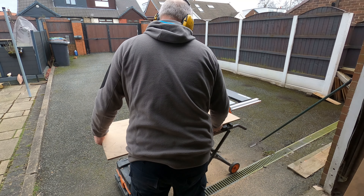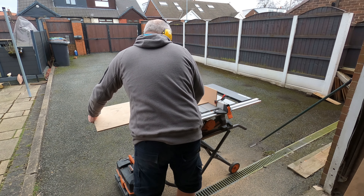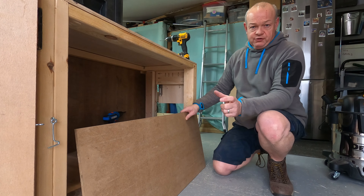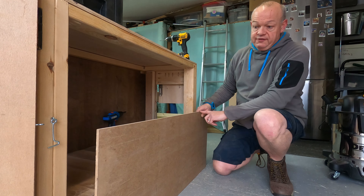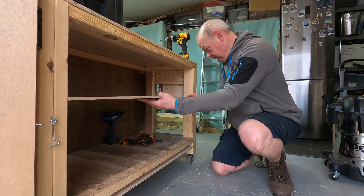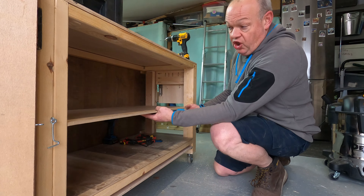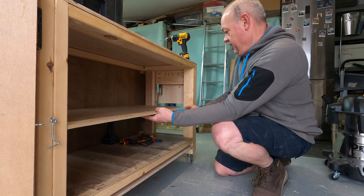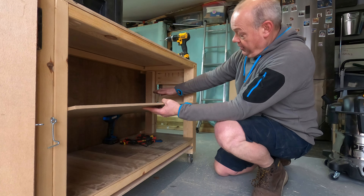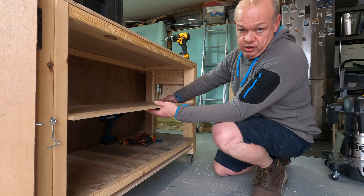Using the sacrificial fence was actually a really good idea — it allowed me to literally just take off the width of the kerf of the blade, which was just the right amount I needed to shave off. I put a little piece of sacrificial MDF on the table saw and took the kerf width off the edge. Much better now. I've still got a little bit of a gap on the right hand side, but when I put in the slides for the drawer I know I've got a bit of space.